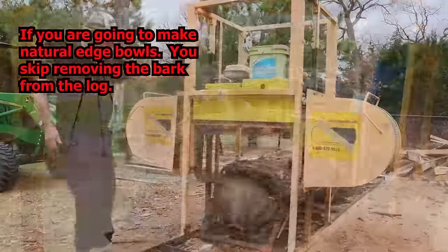One, you would look at this and you would say, wow, that's a big imperfection in the wood. I hope it don't end up in my bowl. Well, that's where this method really pays off. We will outline the problems with the slab before we ever decide which bowls we're gonna take out of it. So we don't start on what's gonna be the top of the bowl, because sometimes a knot or an imperfection will appear on the back side of your bowl, but not on the front, once you cut it out of here.